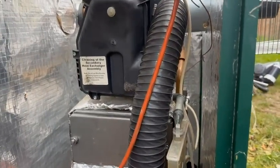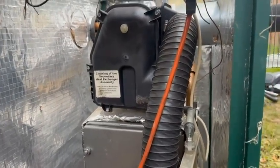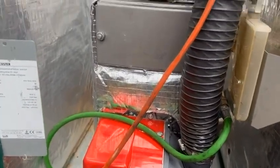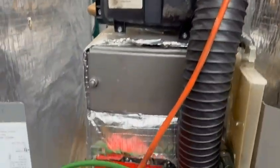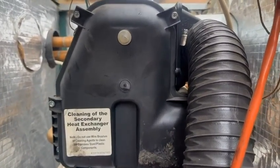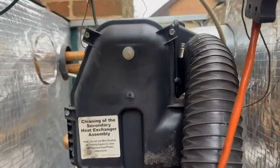Especially on the smaller ones, if you put the wrong nozzle in or the wrong pump pressure, they don't go. They intermittently lock out. They're a nightmare for it. And if one of these soots up, every immortal bit of soot has to come out, especially in here. It's crazy. If you don't get that 100% clean behind there, they will not run properly. They're very well known for it.